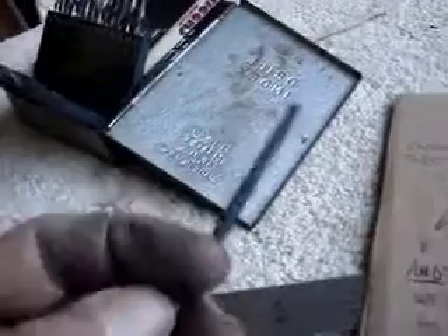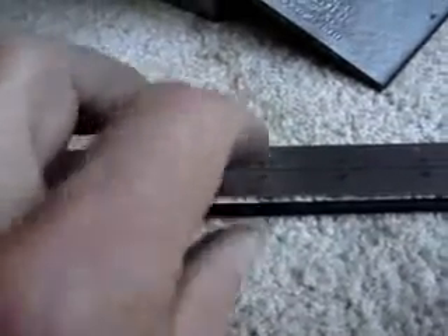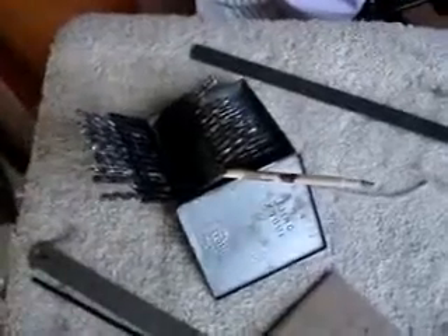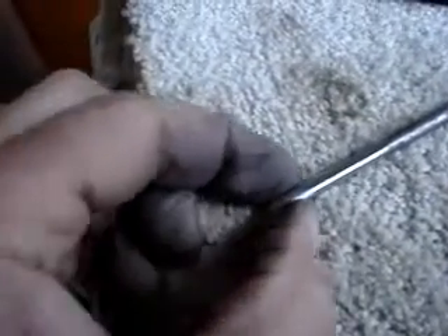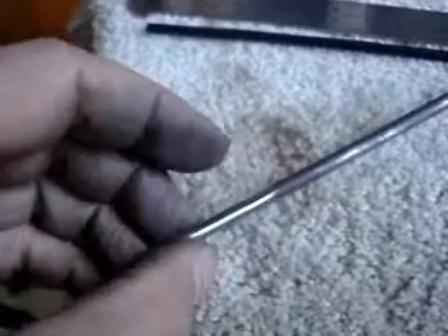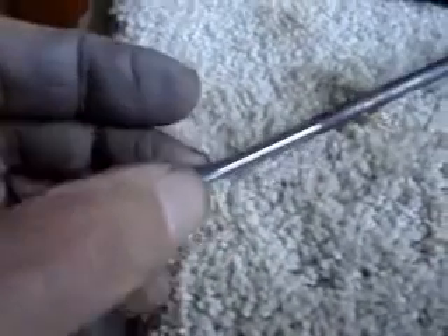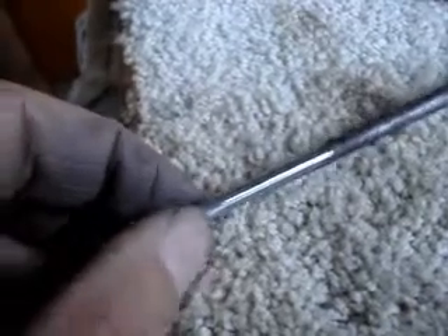I need to replace this with a piece of steel tube, or maybe aluminum tube, or maybe even brass. Maybe I'm going to have to end up making it. I've looked online — I can't get any tubing with a 3/16ths, which is 0.1875. I tried a piece of 0.1875 OD steel rod, which I tapered the tip on very slightly in efforts to get it to go into that hole. That 0.1875 by actual measure will not go down into that hole, so it's definitely not a 3/16ths hole.